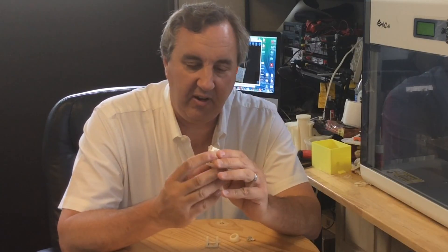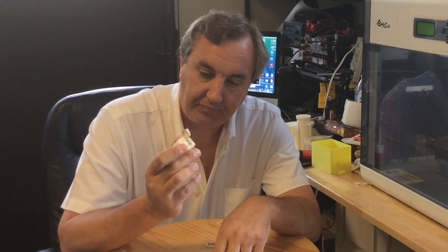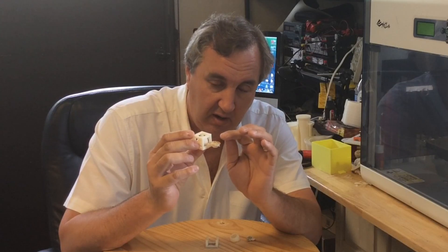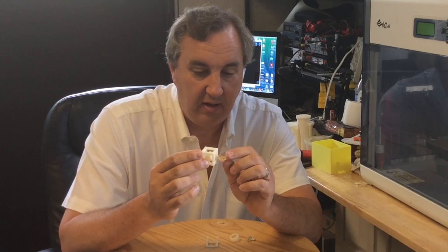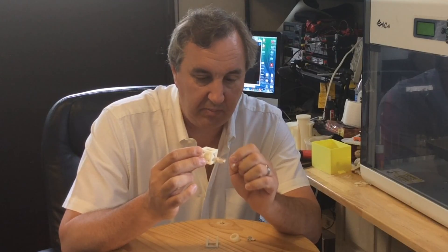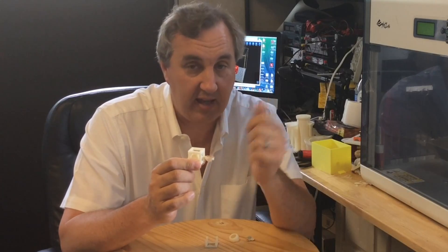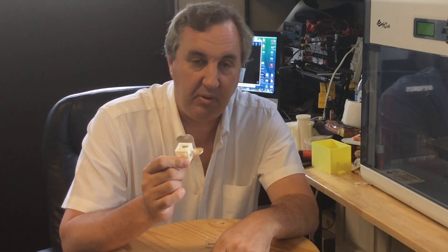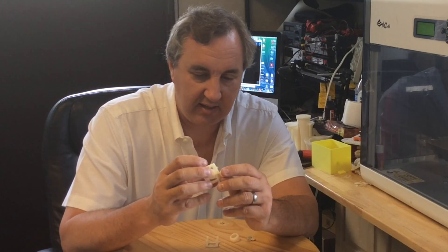What I finally figured out is that the bottom of the ball, right where it should be touching the bottom of the box, was not gripping the bed good enough. It was designed to be offset a little bit, and I didn't print with supports, so there was nothing to hold it. Eventually the head got too hot, melted the plastic, stuck to the extruder head, and as it came around doing the sides, it pushed the ball to the outside. It happened three times — really amazing.